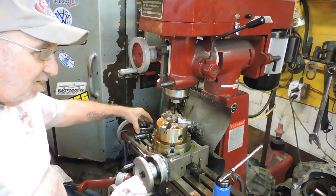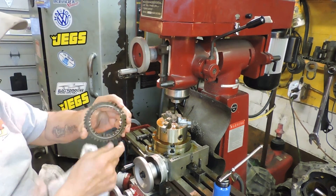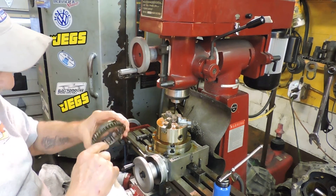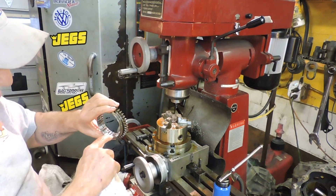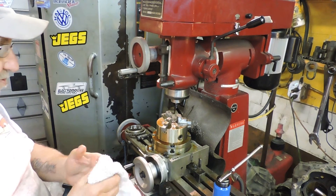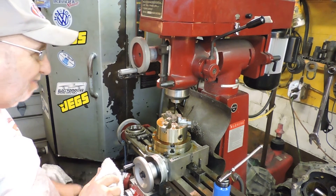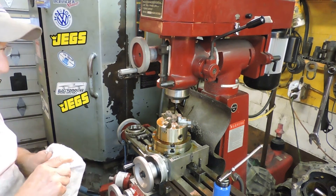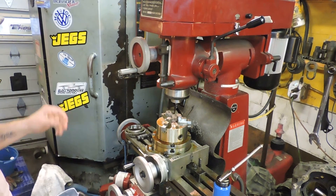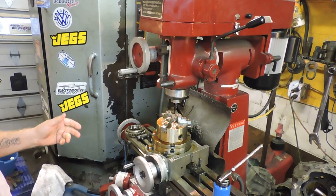But I did a good job on that one — he'll like that. So that's how you cut a pro slider. The other teeth over here are for first, so you don't cut them off — you leave all of them on. But for the pro slider, you cut two teeth off. I don't use pro gears, I will not use slick shift. I know some people like them but I've had too much trouble with them.